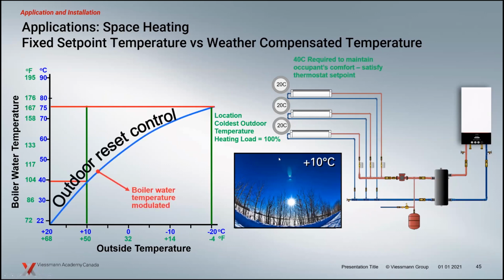No, we wouldn't. So the whole idea there is most of your heating applications, 95+% will react very well to outdoor reset. Whether it's partial, where you limit it to an area, or you go full outdoor reset, depending on the emitters and basically the system itself, the dynamics of it. You have the ability to do that with a 200, where you can put ceilings and floors or whatever on those temperatures to operate within that parameter. But there's always value in adding that outdoor sensor and putting some reset on those devices.